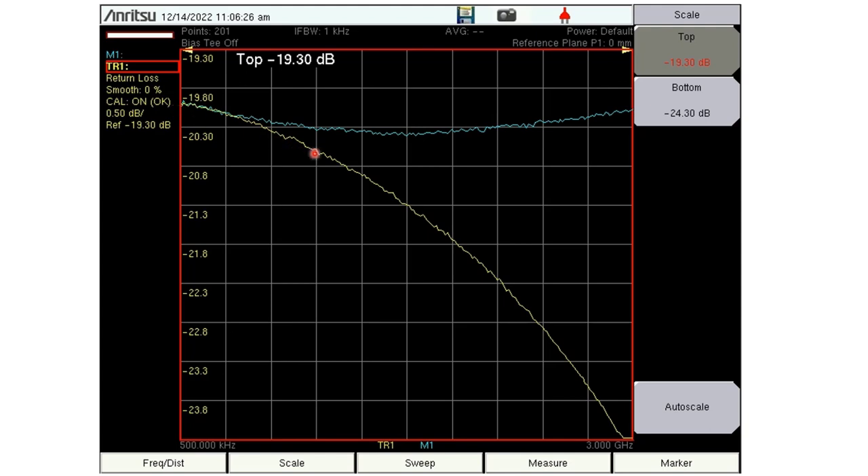As a result, the measurement came out extremely poorly. Don't forget, this is a 20 dB offset we're measuring, so it should be around this area here. But instead, as you see with the yellow trace, the performance drops dramatically. That's because the handheld VNA was calibrating with a specific calibration kit, and we gave it a different calibration kit. Next, I'm going to go over all the different factors that cause this difference in measurements, and how to enter your own user-defined calibration kit.